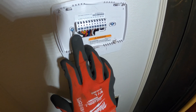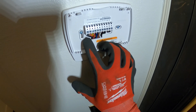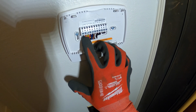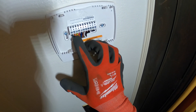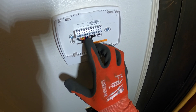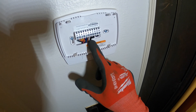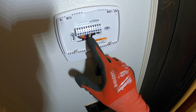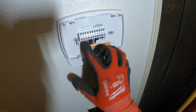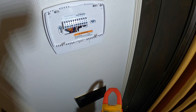We have some labels here — I'll take a picture so you guys can see clearly. It says we have L for line, W/Y, and then Y/A, and then G. GL is low speed fan, G medium is medium speed fan, GH is fan high speed, and N is neutral. It's a line voltage thermostat — L is your hot, N is your neutral, the G's are my three fan speeds, W/Y is heat/cool, and Y/A — well, Y is cooling; I'm not sure what the A would be for.